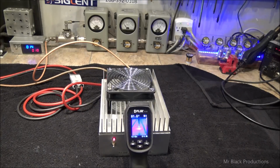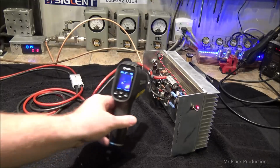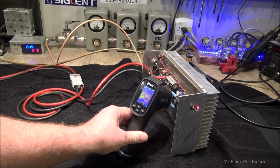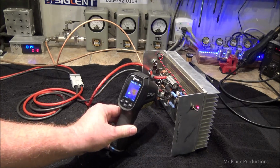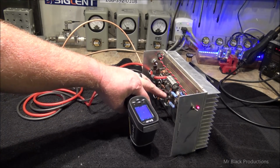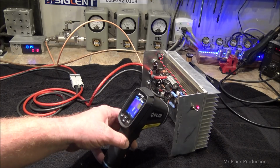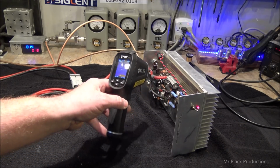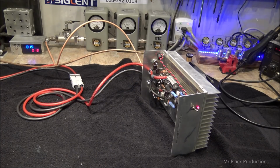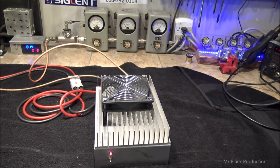I'm just sitting here wondering how long we need to actually keep this in transmit mode. The things that worry me about these little Worthmores is the bias resistors that are in them. So that's at 160 degrees. The tops of the transistors are at 130 degrees. That's at 140 degrees. And what I'm talking about is the capacitors over the output transformer, secondary transformer. The input pad, some of those resistors are 120 degrees, but nothing to get excited about. It's a good working little Worthmore.